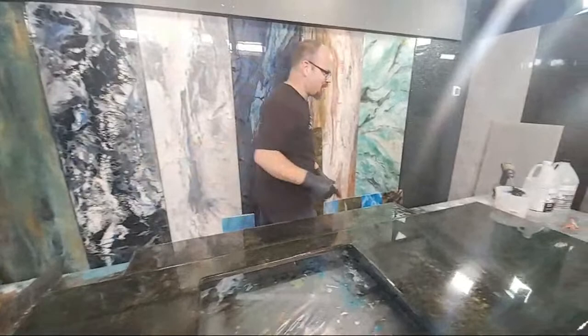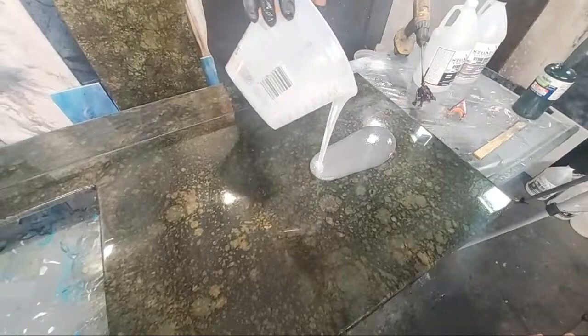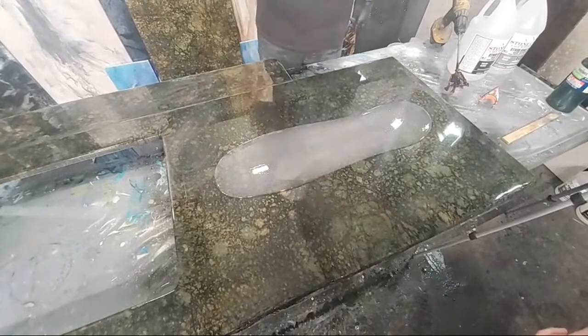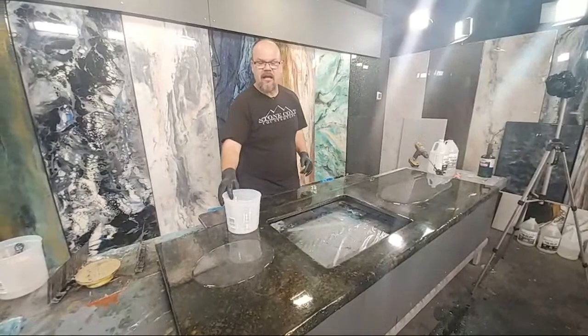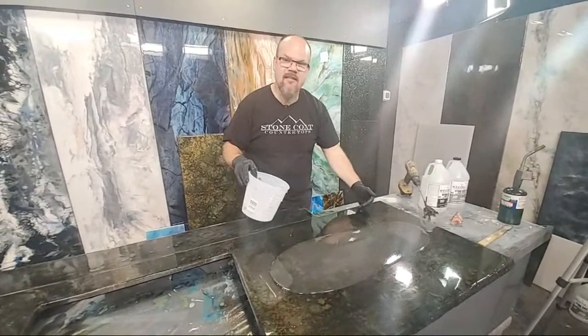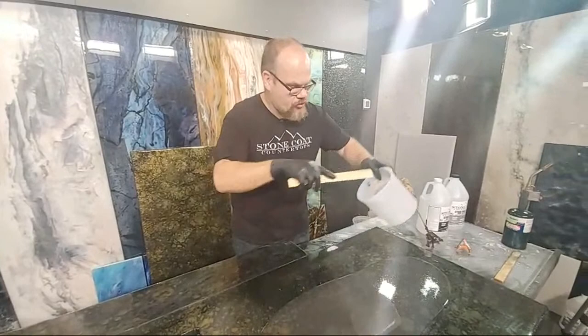I have some material already mixed up, and we're going to pour this out. When I pour, I don't pour right on the edge at first — I don't want my material going over that edge. I go right in the middle of the piece and stop short of my edges. I usually pour my entire bucket on the surface and scrape it all out into the mass. I don't want to do my scrapings over here on the side because this area is usually under-mixed — you haven't scraped those edges really well. Be sure to scrape that out into the mass, and then mix it with the trowel.